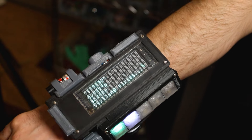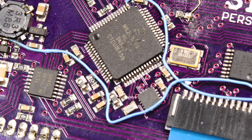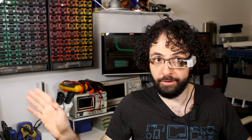So why don't I just buy a knockoff Teensy? Well, that's because the bootloader is proprietary — PJRC locked it tight. If you want to implement a Teensy yourself, like I did with this smartwatch, you can buy a bootstrapper chip directly from PJRC that's pre-programmed with the bootloader for about $7. Most Teensy boards put the bootloader on a second microcontroller, which lets you use every single bit of program memory. Also, you can't overwrite the bootloader and break the chip, which is something that totally happens — but never to me.